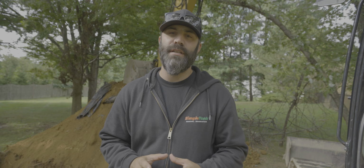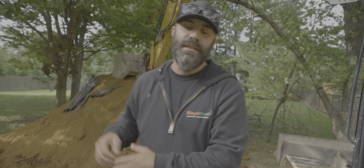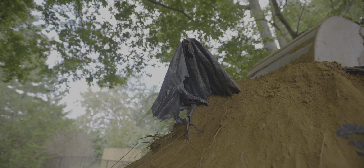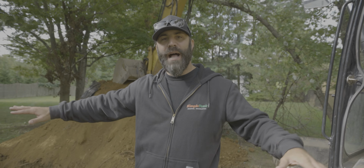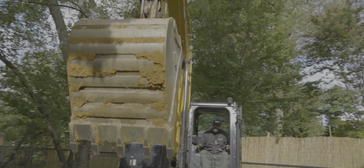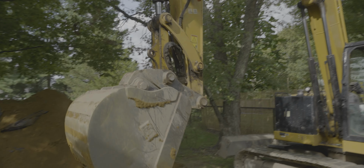Soil remediation is we're going to take the overburden that's on top of where the tank was located. So that's all clean material typically. We're going to take that material and separate it. We're going to get down to the plastic, because on the day we pulled the tank and knew it was leaking, we lined the hole with plastic and put the clean overburden on top of it. So now when we come back, we want to separate that clean overburden to minimize cost for disposal.